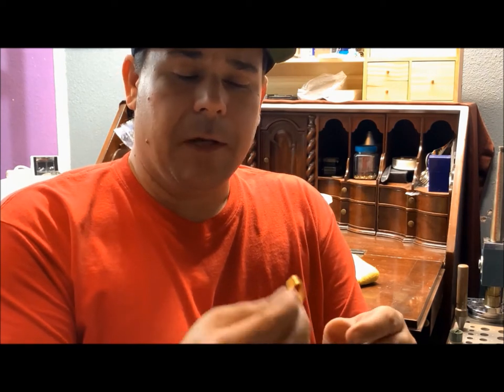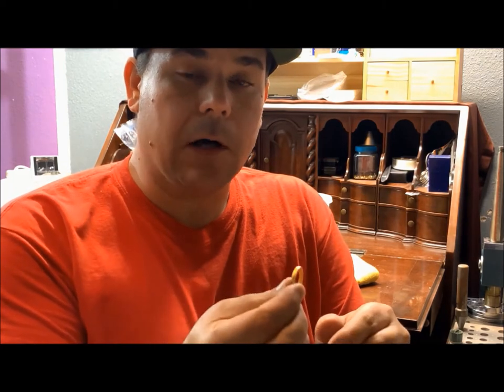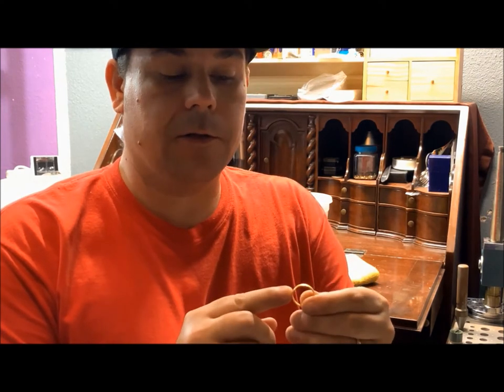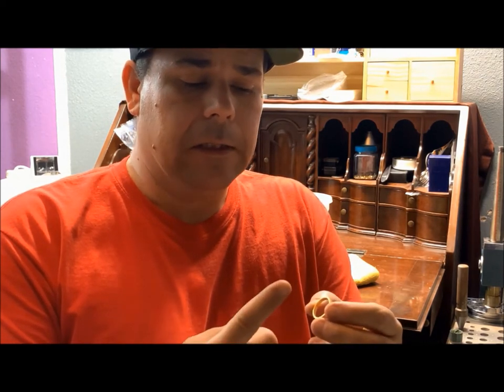The ring itself, even though it may look small, is still a 5.2 gram ring. So in today's market, that's worth right around $300. So maybe then you can understand just a small amount of why even small gold products still cost a lot. Like I said, we refined the gold to put into this ring to 24 karat. It's the chemical process to separate the gold from the base metals and the other impure metals that are in there, and that all costs, as well as the time itself. To get just to 24K, it takes several hours, if not a day or two.